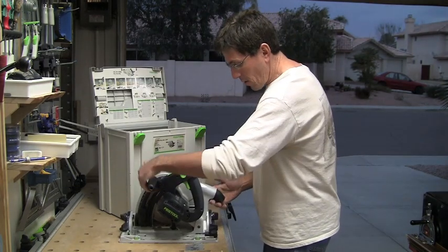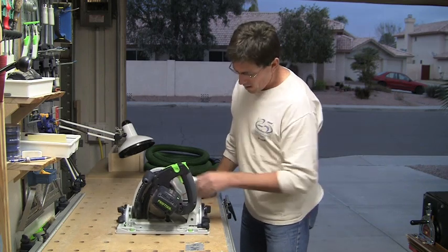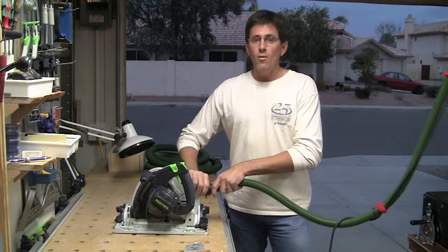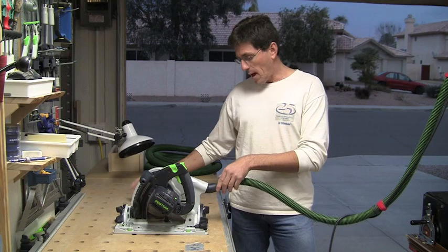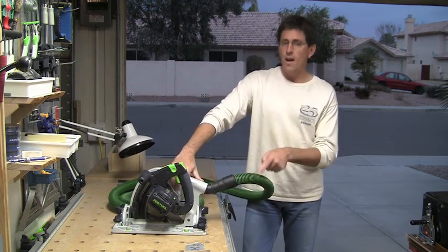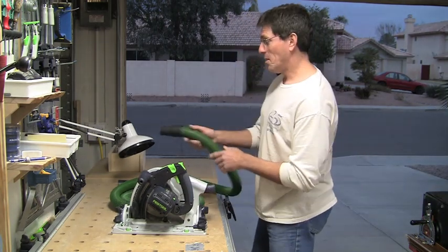Dust collection is always a big thing with Festool. This is the dust port — it's pivoting. You can insert the 27mm hose into the hole; this is the normal tool hose you'd typically use with your Domino or some of the smaller sanders. It doesn't have the airflow capacity you really need if you're doing a deep cut. For small plywood cuts on your MFT it'll be okay, but it would actually be better if you used the D36. The D36 hose will wrap over top of it, so you have a nice choice and you're not locked into one size. In all honesty, I use the D27 almost all the time on my MFT only because I'm too lazy to go get the D36 for a couple of cuts.